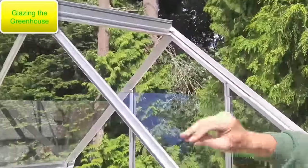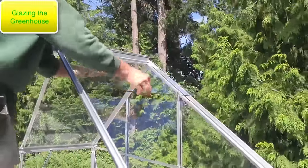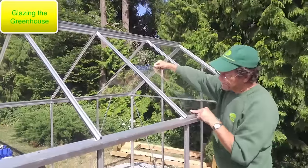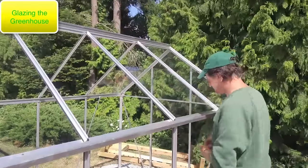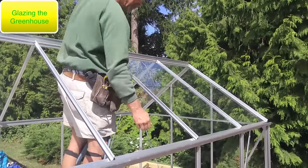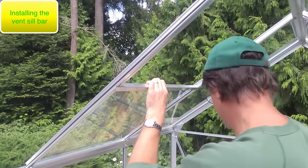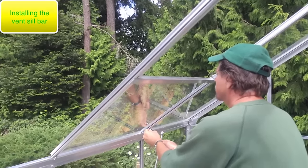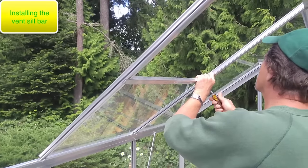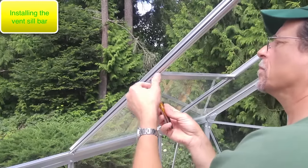Time for glazing. It's not shown in this video, but you'll have to put in that little rubber glazing strip — the small black piece of rubber you see on the left and right-hand sides. I've put a piece of glass down and secured it into place. Every time you do that, if there's a glass pane above it, you have to put in glass retaining clips. I'm putting the spring clips on now. Here's the sill plate detail — remember you would have had to slide an extra pair of bolts up to where you've determined your roof vent will be. The bottom of the sill plate has a slot that takes the bolt and secures it into place.